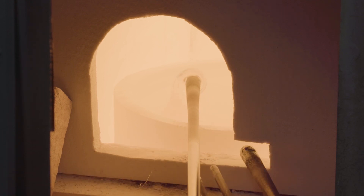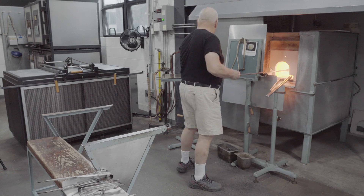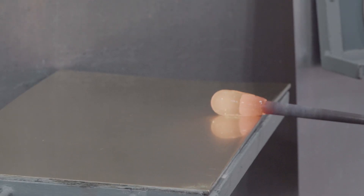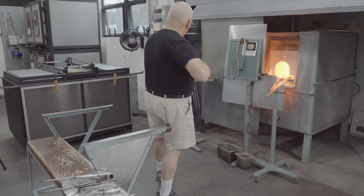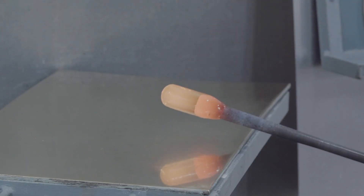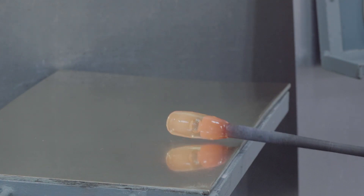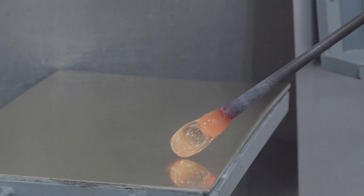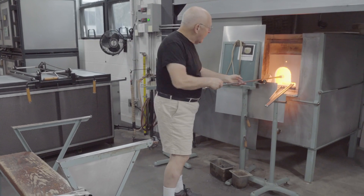The cup is very thin, so very little glass is gathered on the end of a small blowpipe. The glass is marvered to make the gather slightly cylindrical. Air is blown into the blowpipe for the initial bubble. The blowpipe is then held downward slightly to elongate the gather, and the tip is rubbed against the marver to make the tip slightly pointed and slightly cooled.